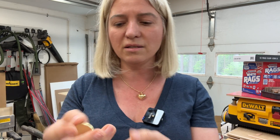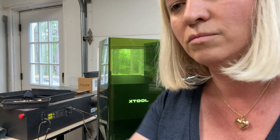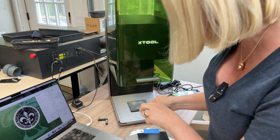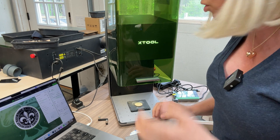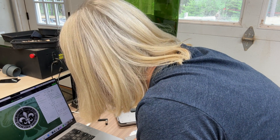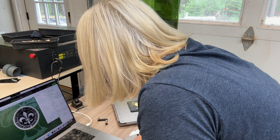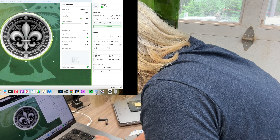The coins come in these plastic cases — just a blank coin. I'll bring you to the machine and show you all my settings. I have a slate in there just in case I don't frame right — I don't want to engrave the metal base. I'll record my screen so you can see exactly what's happening. I have this depth map image I really like, a cute design. When you pick your design and put it on your material, make sure you're set to the Emboss processing type.